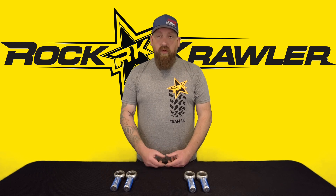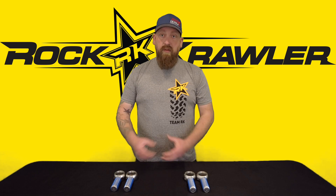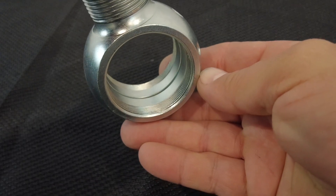One of the things we did was go to a one-piece bushing, and with that one-piece bushing we've introduced a way for grease to travel directly to the ball rather than through a channel that floats around the bushing into the housing. Today we're going to show you how to fill in the grease groove so that your old housings will look and function just like a new housing, and this will allow you to run the newer one-piece style bushings in an older housing without any issues or bushing fatigue.